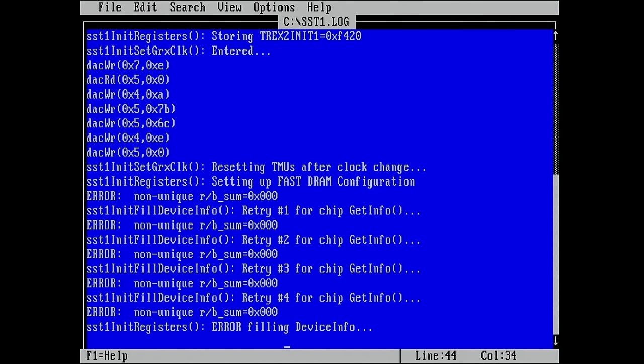So I'm hoping that this is because of missing memory on the FBI chip. If the Voodoo 2 is similar to the Voodoo 1, then it should at least give more information with the FBI memory. And even though there is no texture mapping memory, it should give us a different output. So let's do some soldering and repair those few pads that have been ripped off the PCB.